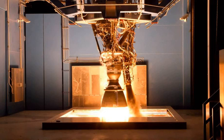The basic Merlin fuel-oxidizer mixture ratio is controlled by the sizing of the propellant supply tubes to each engine, with only a small amount of the total flow trimmed by a servo-motor controlled butterfly valve to provide fine control of the mixture ratio. On November 24, 2013, during a joint teleconference of SES and SpaceX regarding the SES-8 launch, Elon Musk stated that the engine was actually operating at 85% of its potential, and they anticipated being able to increase the sea level thrust to about 730 kN.